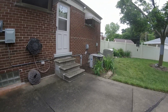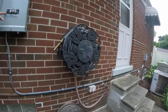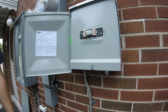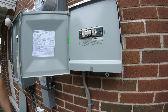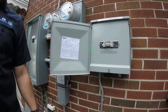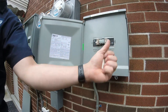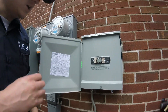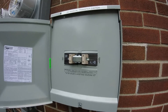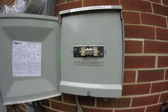And then the AC manual transfer switch — so summertime when you want to run on the generator, right now it's on utility. All you're going to do is flip it to the generator. That big old thing just keeps it from back-feeding. That's where we want it right now, on generator. It's just like a normal breaker — it says 'on' right there. And then back will be utility.